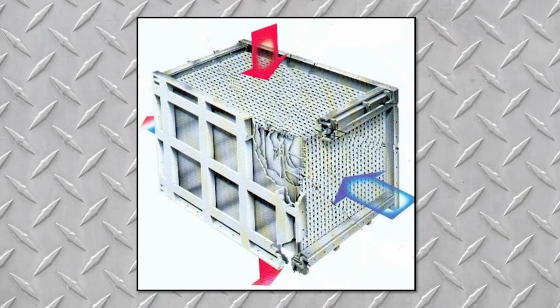When taking energy from an exhaust stack, there are limits. You really need to keep that stack temperature high enough so that you don't get condensation inside the stack, which can mix with acids in the flue gas and start to eat away your flue or other parts of your furnace system. So you have to look at what the dew point is in the stack based on the fuels being used and keep well above that. But other than that, we can use either a regenerator or a recuperator. The simplest solution may be to preheat the air before combustion. We put the air intake through a heat exchanger that interacts with the exhaust and raises its temperature.